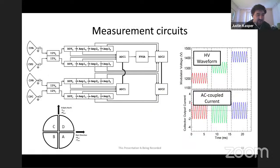The four collector plates are arranged in 90-degree wedges, giving independent measurements of north, south, east, and west flow angles with redundancy - if you lose a collector plate, you can still recover the full vector flow. We have a current-to-voltage conversion process, bandpass filtering, and three levels of amplification. The cup digitizes 16 time series and converts these AC-coupled currents into AC voltages. A cool advance on the Solar Probe Cup development is we do a digital FFT of those data to pull out the power at the modulation frequency, as opposed to the more old-school analog lock-in process used for earlier Faraday Cups.